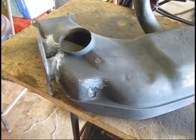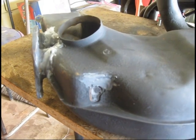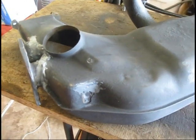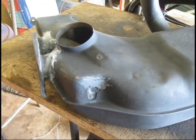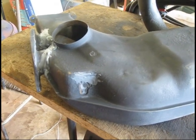All right, tubers. We want to try to get these bolts extracted out of the heat exchanger here. I'm going to get me a center punch, get my drill bits, easy out, so on and so forth ready, and we'll see if we can get these out of here.